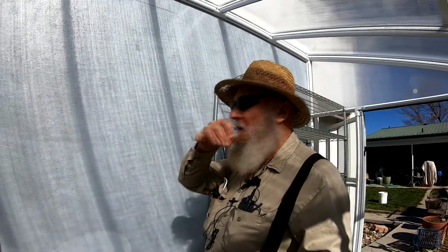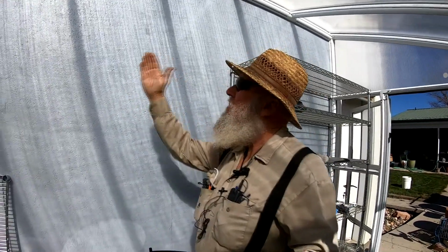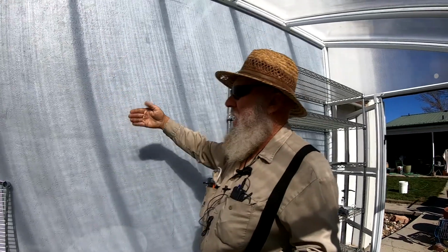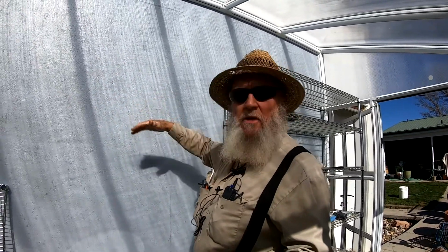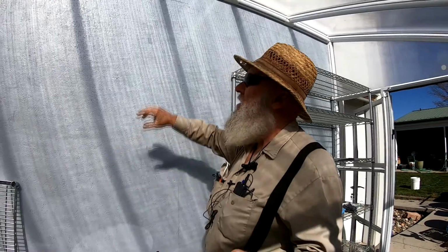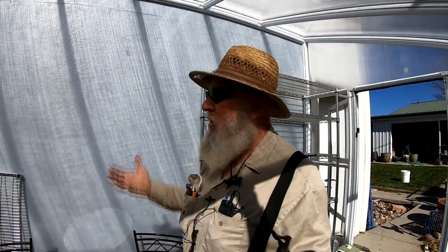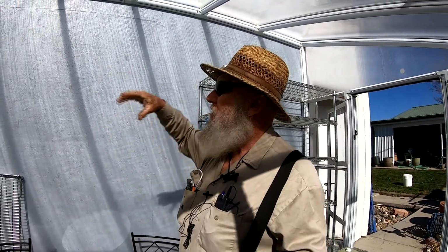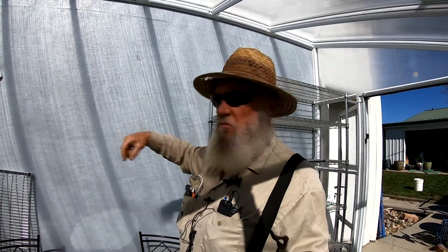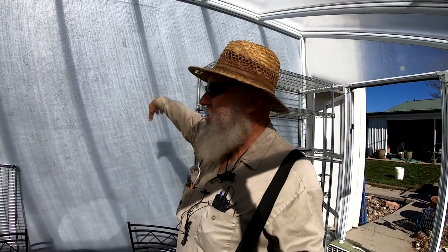So anyway, my plan is, before I could erect the greenhouse, I had to deal with this metal building, which has the corrugated metal, so I had to put some studs on there, shim it out, everything, so I could get a plumb surface. And then we actually put insulation behind here. So what I'm going to do is go up in this wall here and install a couple of exhaust fans. I'm going to put them on a thermostat so that as soon as it hits 80, they'll kick on, and it'll exhaust that heat into my shed.